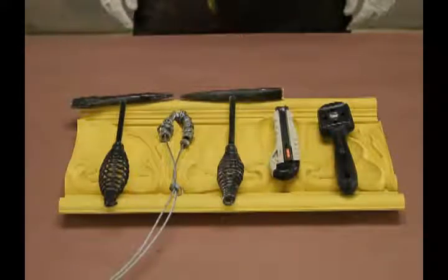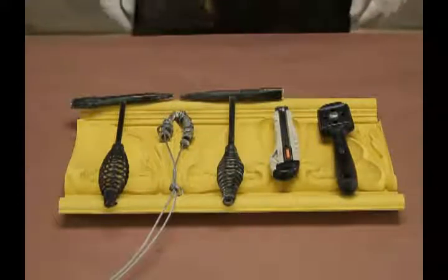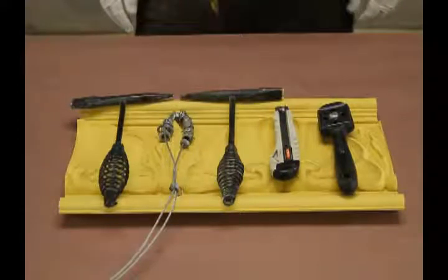The second to the right, which is the little chain with the little nuts and bolts, is a slapping tool that we use to give large panels indentations. We also have a utility knife, and we use a flat wood scraper, which is the very last tool on the right. Sergio is going to help me today, who is my lead finisher.